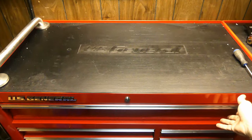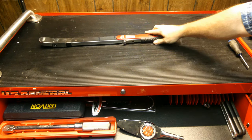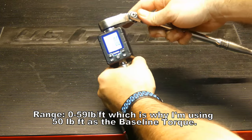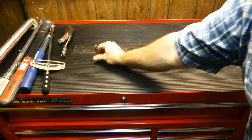The answer may surprise you. I have a couple of torque wrenches that I use regularly. I'll be doing some testing with this 1/2 inch drive Icon twin beam style at 50 foot-pounds. In order to confirm torque at the socket, I'll use this Quinn 3/8th drive torque adapter, which will merely be used to verify how much twist is on the socket itself. And I have a few extensions in my collection as well.